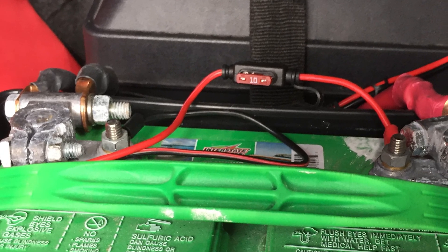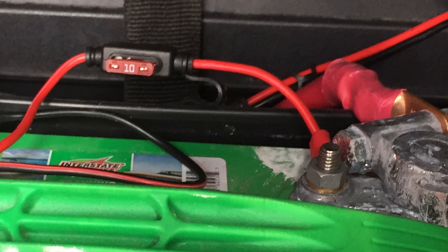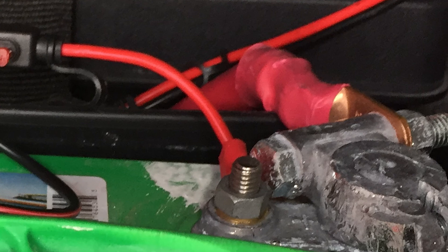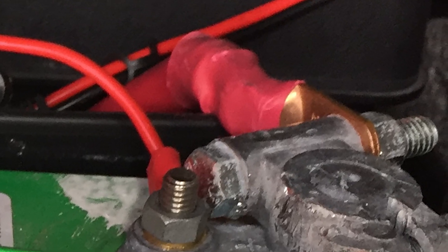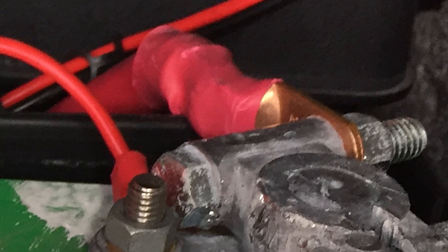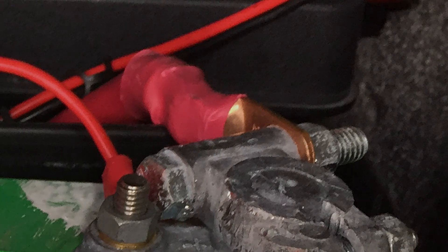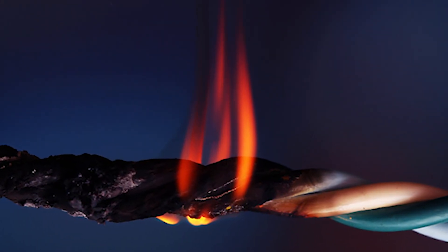Either is a real possibility — in fact, I blew both fuses on the first day. If the Y-splitter is left connected while only one battery in the boat is active, it is possible for the second battery to attempt to provide additional power to the boat across the small SAE cables and Y-connector. Notice how large the cables are that provide power to the boat. This does not pose a risk to the boat's electrical circuits, but if the fuse were not present, the wire would overheat until it was glowing red and create a fire hazard, putting the boat at risk.